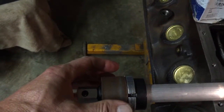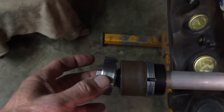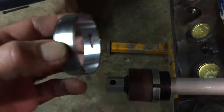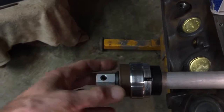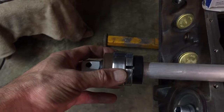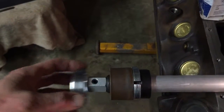Be sure to keep this rubber grommet clean, because this is where your bearing surface sits while you're driving the bearing in — you don't want to drive grit or dirt into the bearing surface. There's a tightening nut: as you tighten it, it expands the collet, which pushes the rubber outward and grips the bearing tightly. So when you drive it in, you drive it straight with smooth hits — the bearing isn't moving around because it's snug on the rubber grommet.